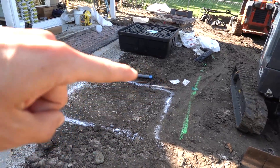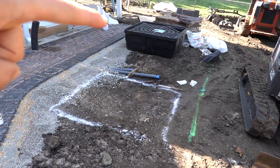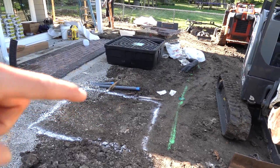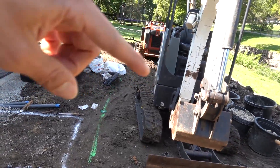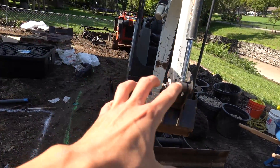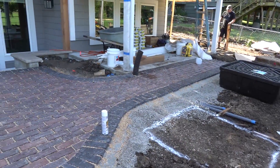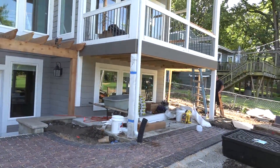This is the area where our reservoir is going to go — that is the Aqua Basin right there. We'll go ahead and excavate our space in the ground for this, put all of our excavations where the machine is, and we're going to berm up this area to get the flow of the waterfall facing back toward the patio space and the deck.